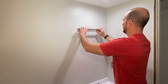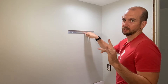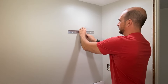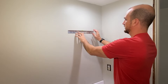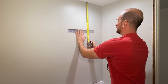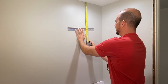Now putting the bracket roughly into place, I'm aligning one of the holes — not the slots — to the stud. The slots are what you'll use for the other two mounting screws, but if you can find a stud you really want to line up one of those holes for a tighter fit. The kit does come with a small bubble level which you can set in the middle on top of the mounting rail to make sure everything is level. I need to confirm I have 14 inches of clearance — I'm going to give a little extra on the top side and go 15 inches, so this is roughly where I need to be for that top rail surface.